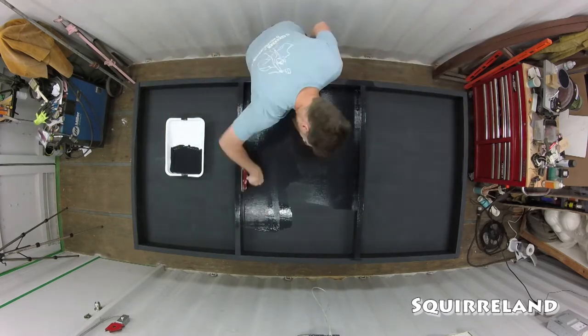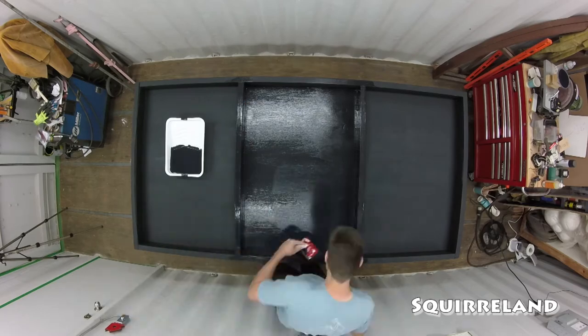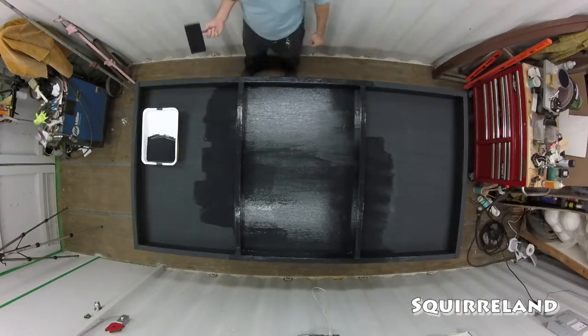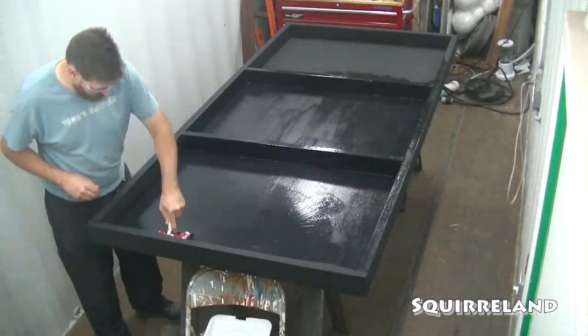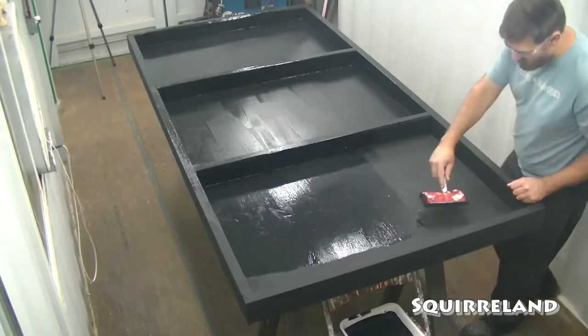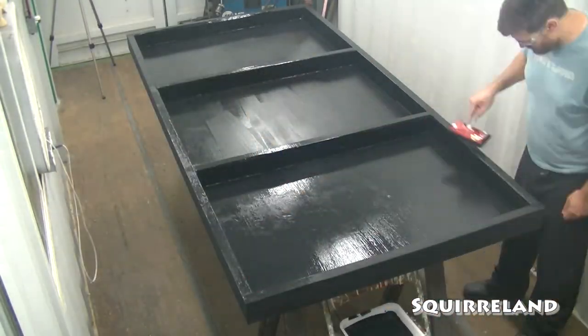We initially made all of our panels with flat paint on the backs, but unfortunately, we had issues with mildew growing on them when they were in storage for 9 months of the year. We recoated the backs of all of our panels with semi-gloss paint. Ever since then, we haven't had any more problems with mildew growing on them when in storage.